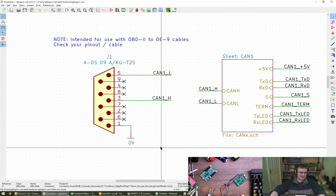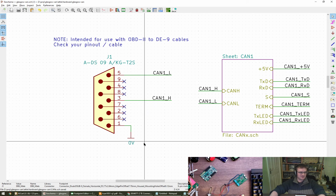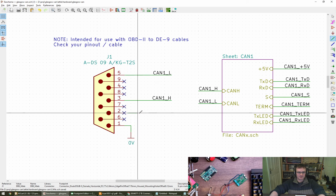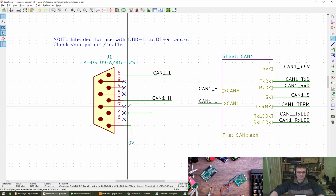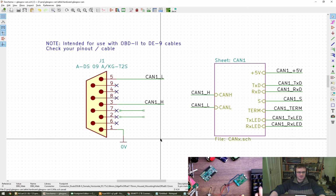Rachel had a pin out, and then Rachel referred us to the, I can't remember who makes it now, CAN adapter, which has another pin out, and so most of your tools use 2 and 7. 2 and 7, yeah, okay. I think that lines up with one of the products we were looking at, PEAK-CAN, that's the one, yeah. So, to be honest, I'm slightly wondering about whether we put a pair of pin headers that we can then just allow people to jump across. Omni Technomancer, are you saying that PEAK-CAN uses a different one to NI? Because that wouldn't surprise me at all.